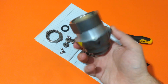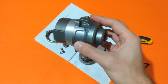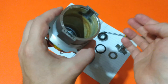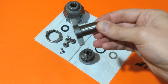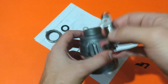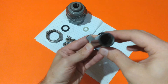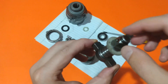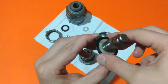After removing most of the grease, this is what I managed to disassemble from the hammering mechanism without totally destroying anything. First of all we have the metal casing which is made of solid aluminium — which is understandable because of the forces applied inside. We have here an aluminium bushing and of course a lot of grease. Next we have the so-called anvil — this is the part that is protruding out from the casing, and this is the part where you attach your socket. We have a dust protector over here and this metal washer.